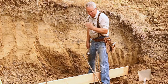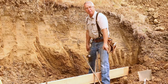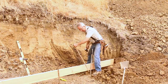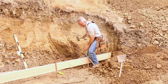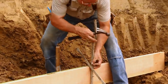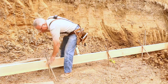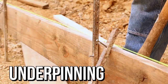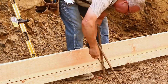With a 12-inch face you've got a lot of pressure. The vertical stakes will not withstand it — you'll get bows, you'll get blowouts. So you put kickers on here. A kicker is a stake put in at about a 45-degree angle back to the ground to provide resistance to that overturning moment. You lay it up against a vertical — you don't put it out in the middle because when you're rodding the concrete you've got to jump around a brace and a vert. Put them right up against your verticals. Underpinning is the form material that goes below the initial board which sets the grade, just to reduce leakage, control spillage, and control how much concrete you use. We're going to underpin this with a 2x4.